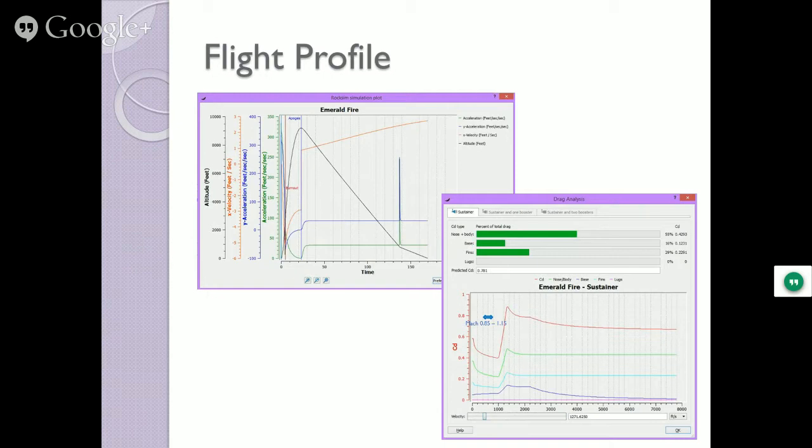You're in good shape until you see where it does that little jump up, in the bottom graph? That happens between Mach 0.85 and Mach 1.15. Chuck Yeager and those guys, that's when they talked about the wall, the barrier, right at Mach 1. That's what they're talking about. The whole dynamics of the rocket's flight and the fluid dynamic equations for what it's trying to do going through the air change dramatically. And if you don't design a rocket to go Mach 1, and you put a big motor in it and you're not thinking right, and you launch it, I've got a video that shows you what happens when you do that.